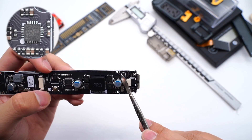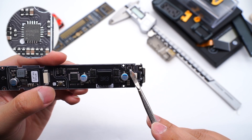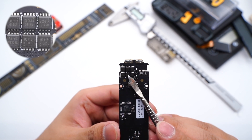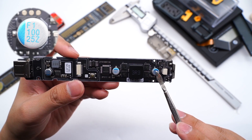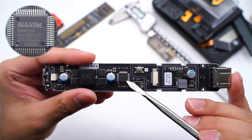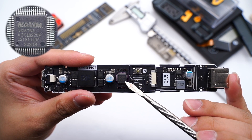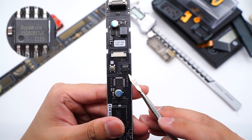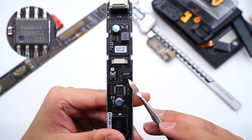This is the battery monitoring and protection IC, marked with MT006C6UB. Here are 6 MOSFETs for lithium battery protection, marked with B3115. This is the solid capacitor for input and output filtering, 25V 100μF. The MCU is marked with AOC18220F, and is responsible for data collection, power control, and display drive. The flash memory stores data and comes from Boya Micro BY25Q80BS.